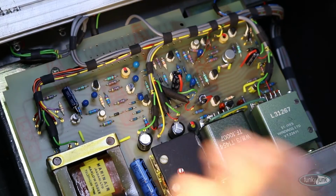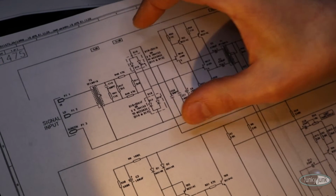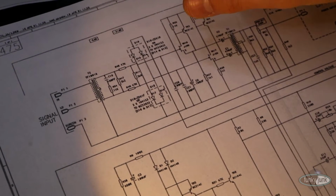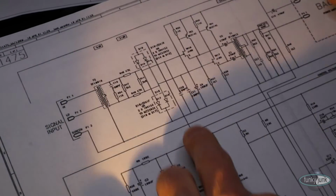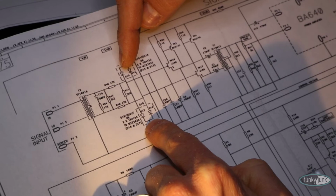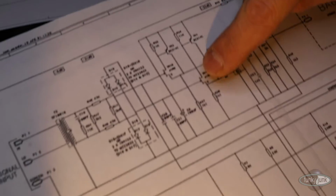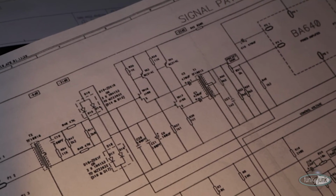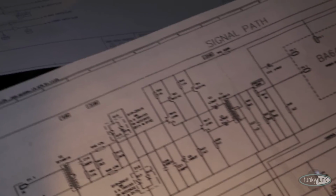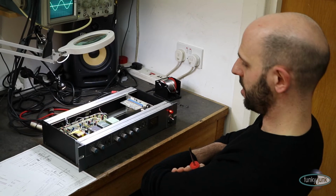What's clever about this is that we are using a diode bridge, which you would normally use to rectify voltage on a power supply, to reduce the gain of the signal. It's very clever because you put the signal into two legs, you feed your sidechain into the other two legs, and then you pick it out and feed the rest of the compressor with it. There are two FETs here to match the impedance of the bridge. So it is by definition a very colored compressor. So that's your 33609 or 610 compressor for you.